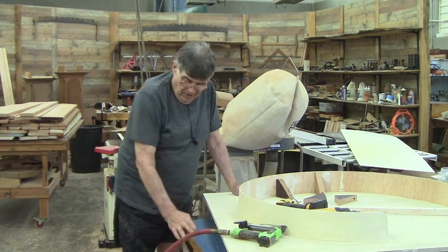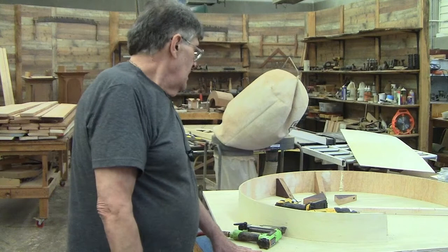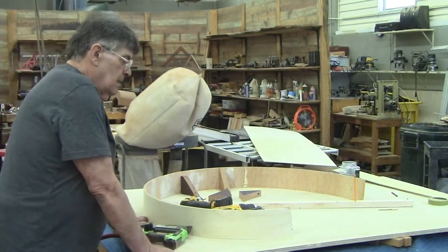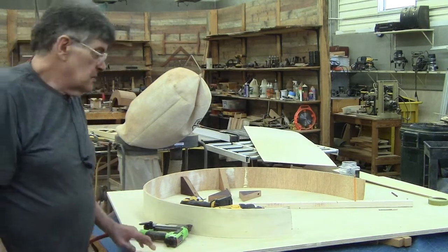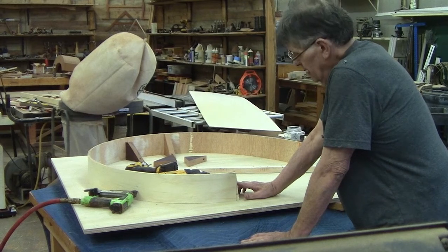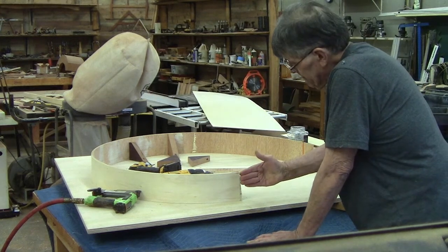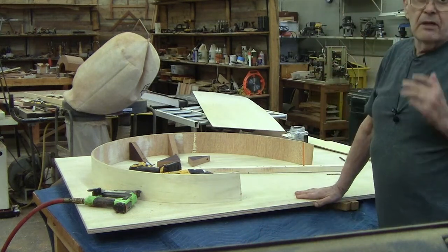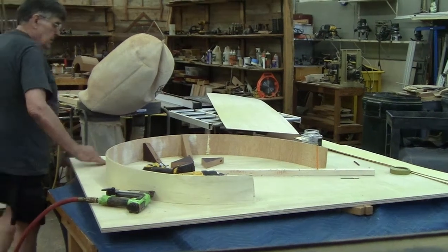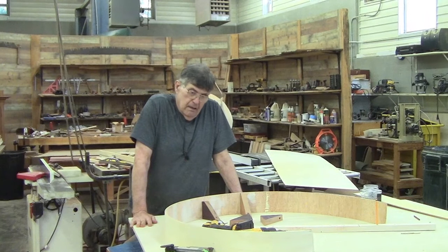So how, again, how are you going to know what length so that you can come up and butt and you have a nice clean... What Jeff's asking is, well, once we get all of our supports on and we get the base on, we can measure it. Well, here's the other thing. When you're doing this, now see, like right here, what I would do is I'd put another support. And the reason for that is then I can pin tack this, and I don't want to overlap. And I would butt to it, but then the next piece, I would straddle it. You understand? Just like laying a floor. You never want to keep your joints going the same. You want to stagger it. And you got an apron.